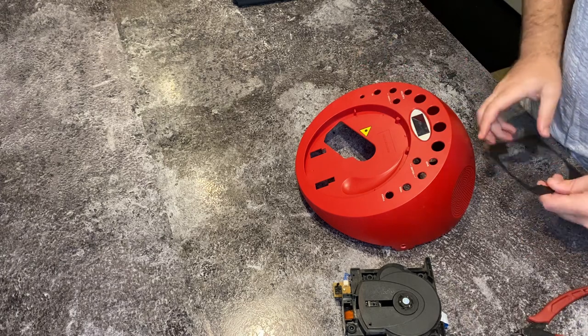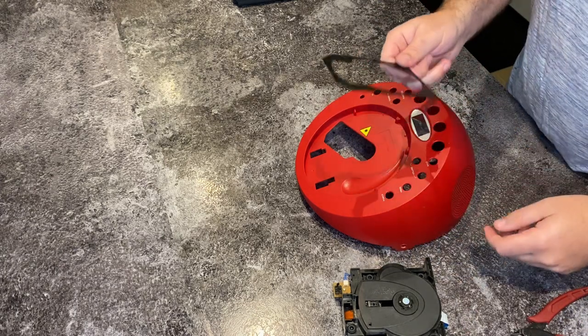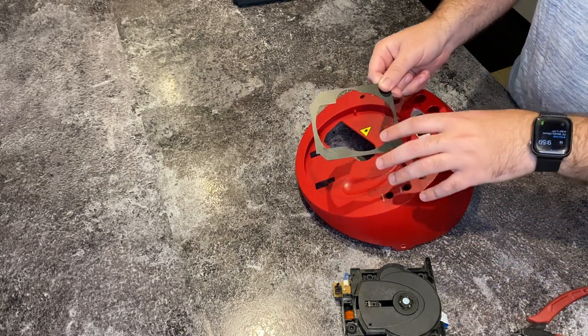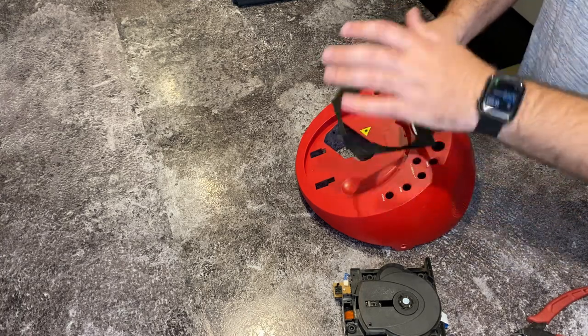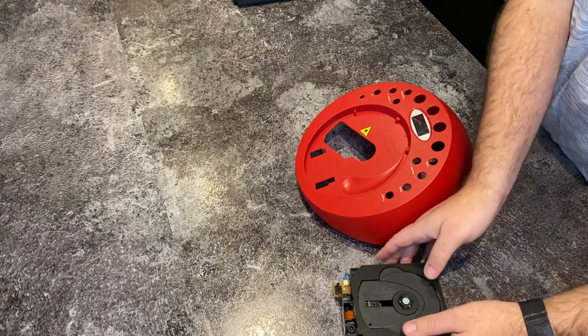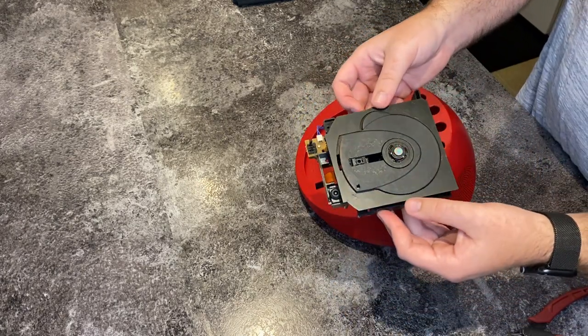It's not great. But I found this — well, part of this. Somebody had made a new upper lid for the GameCube to house full-size DVDs. What I did is I took that model and pretty much cut away everything that's not the outline of the disk drive, and this fits really well on top of the disk drive, so it's a good cutting stencil.